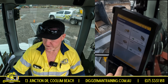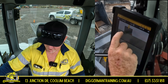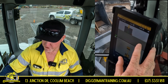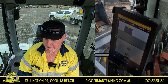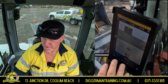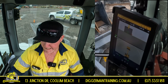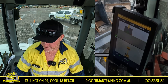Right, out of that. Now we'll go into our main screen — let's just hit start. From here you can scroll across to select what screen setup you want, views, things like that. The two views you're going to need to know and will commonly use are your cross section and your plan view. Your plan view will show all your line work and just a picture of your machine. Your cross section is the view you'll commonly use all the time — it simplifies it to basically just a picture of your bucket, and that green line is your finished surface showing curbs, batters, drains, and profiles. You basically just follow that green line and you can't go wrong.